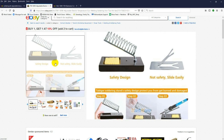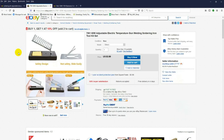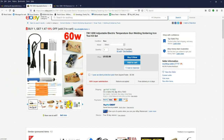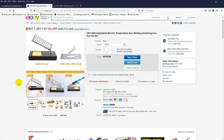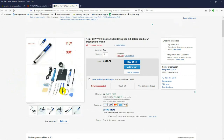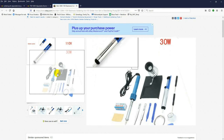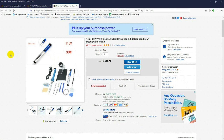There are some things to think about while looking for a soldering iron: either get a 25-30 watt fixed or get an adjustable. Get yourself a good rest to put it in. Make sure the kit comes with some solder and the desoldering tool, which is the solder sucker. Just go through and find the kit that has everything you need — they're not expensive, this one is under $10. I hope that helps.